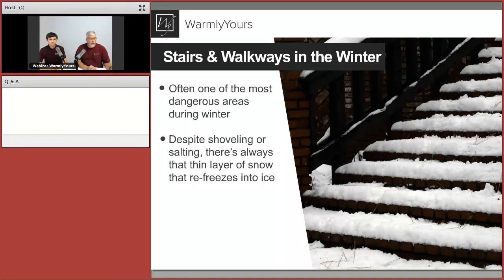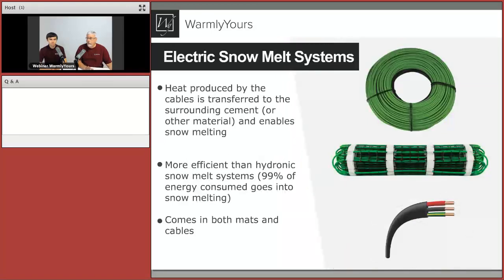So what we're going to do with electric heating is we're going to get rid of all that. So let's take a look at the electric snow melting systems. And Anatoly, go ahead and talk to us about this. Sure. So electric snow melting systems that we provide, we have in two different types. It can be electric snow melting heating cable, or it can be a mat product that pretty much has that cable embedded in the mat and pre-spaced.